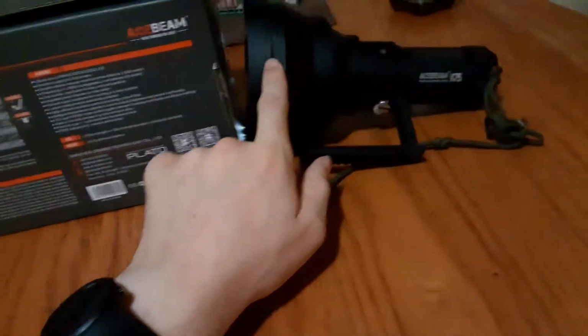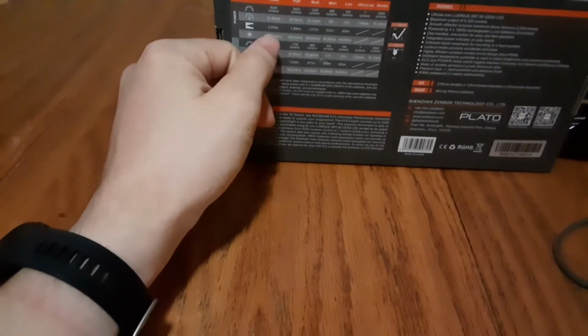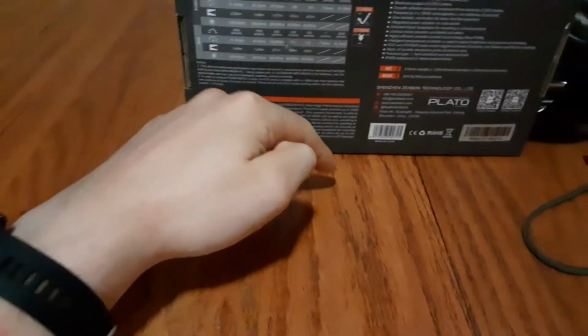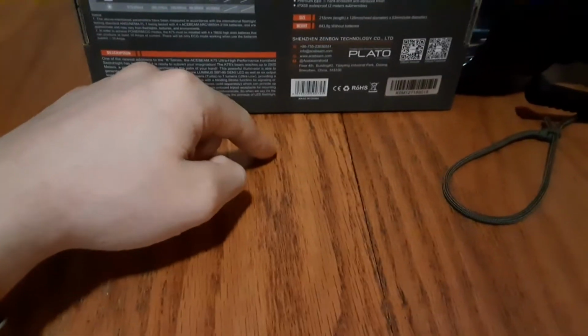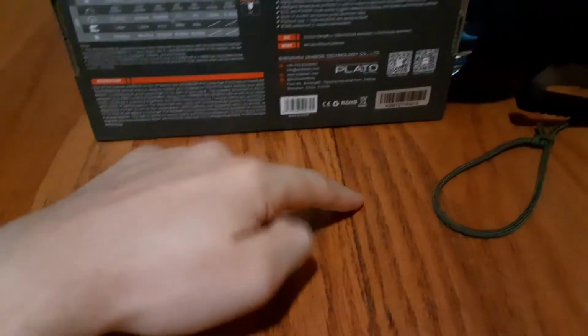So the light over my head might have 70 meters of throw or so, and that's where it's fizzled down to a quarter of a lux. This thing's quarter of a lux makes it a ridiculous distance of 2,500 meters. And that means that at 2,500 meters at sea level, the calculation takes into consideration atmosphere. It is a myth that it doesn't. It is not based on a vacuum. It is based on the atmosphere. In fact, it's based on relatively thick atmosphere at sea level.